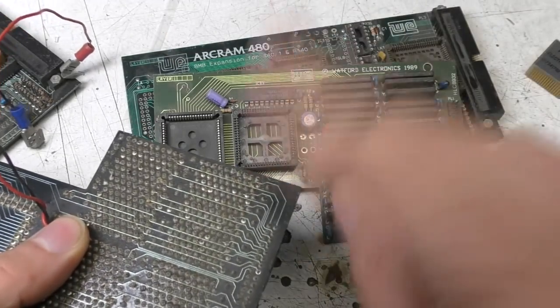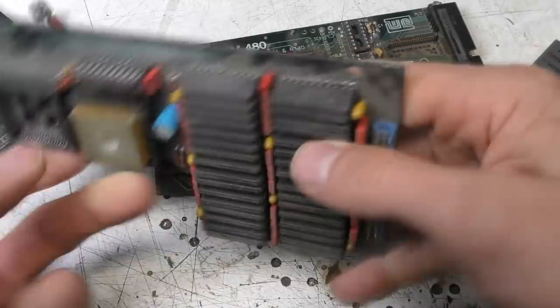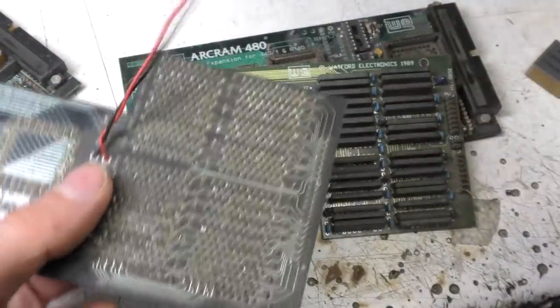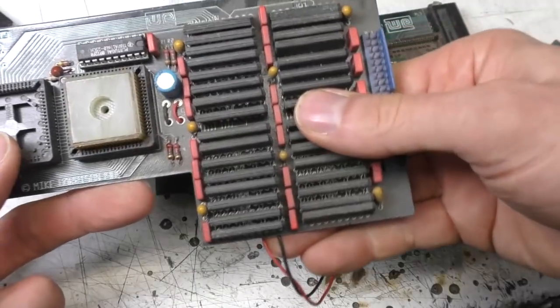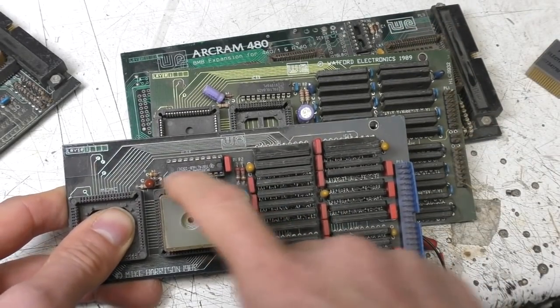Actually, I think on these ones plugged into the video. That was right. The video processor had the data bus, and the memory controller only had the address bus. So we needed to tap into both of those to get the full address and data bus that we needed to run these. There's not much in the way of logic, but we did use a PAL for this.